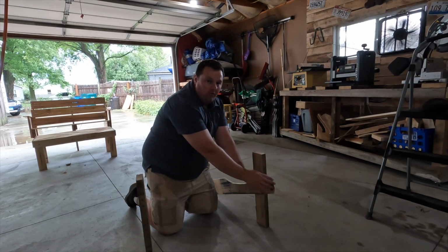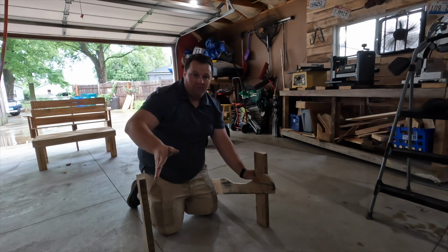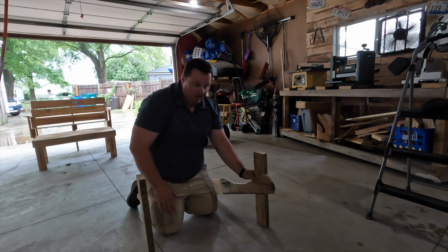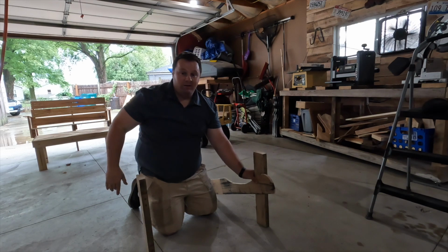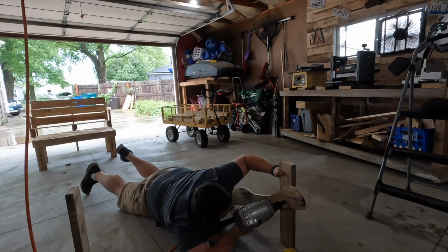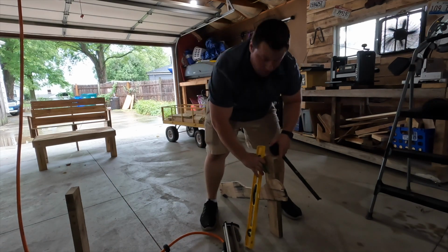I was just trying to get a little bit of overhang, because obviously you don't want that at the very, very end. I laid all 4 of the templates down on the table together, made sure they're right one on top of each other, and put a notch across all 4 of them. So my mark is in the same spot. So now I can just assembly line, go along, and they're ready to go. I know exactly, just go to the edge. I want that at the highest spot, right there. My height is right. My hand is out of the way. I'm going to measure exactly how high up this one was. It was actually at 15 3/4 inches.